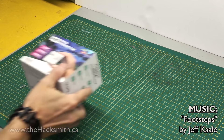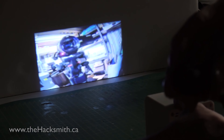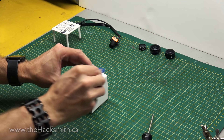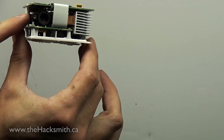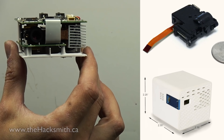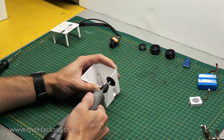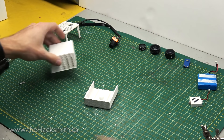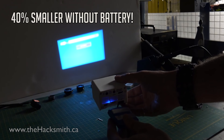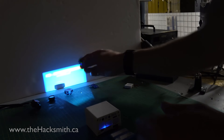Next up, let's add the most iconic feature of the umbrella: adding a screen so you can see through it. The projector module inside is actually quite small — it's this little black box here, which is only connected by a ribbon cable, so it would actually be possible to make it quite a bit smaller. The only problem is the circuit boards are going to be tricky to place in the umbrella. To make sure the projected image covers most of the umbrella, we're going to convert it to an ultra short throw type projector using a wide angle lens meant for a cell phone camera.